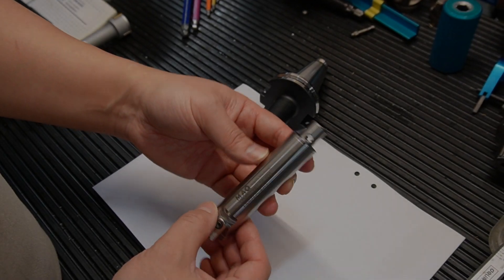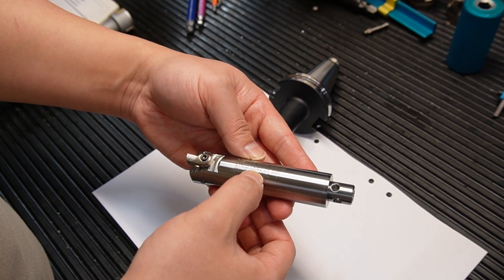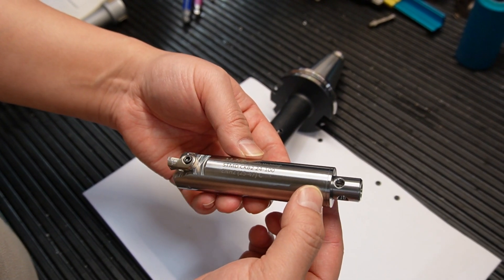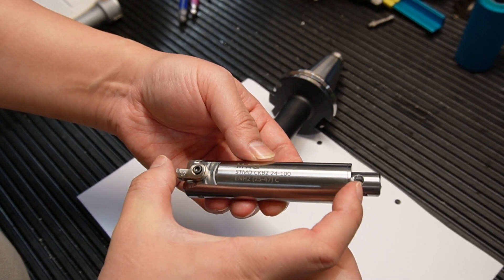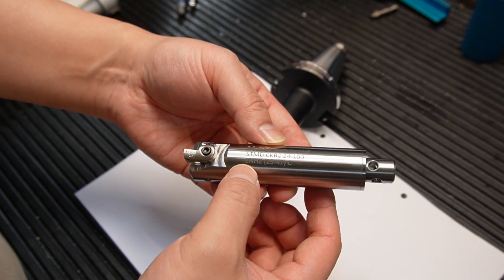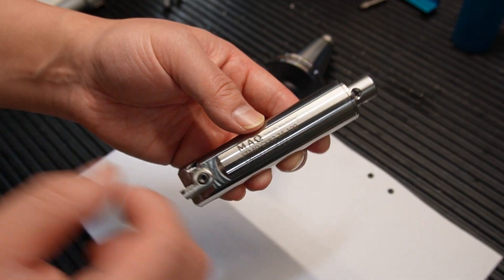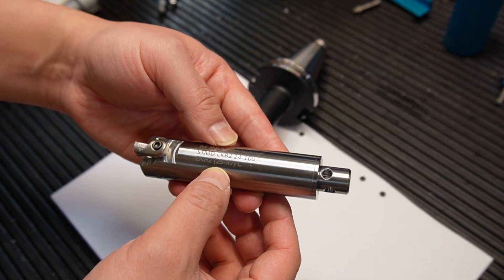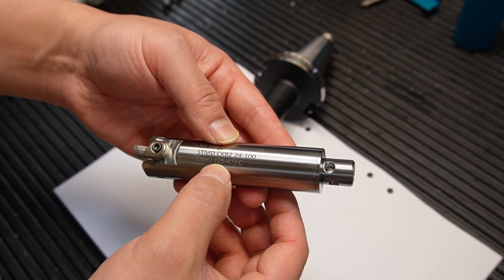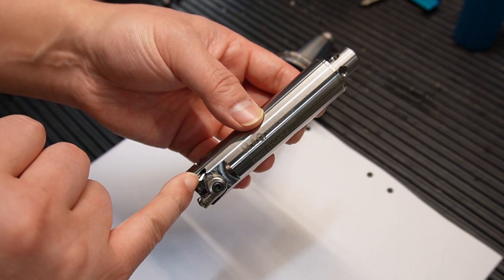What I'm holding in my hand is a CKB2 type, and the diameter of the body is roughly 24 millimeter. The total length is about 100 millimeter, and it has an ENH2 type connection to the insert holder. With this body, you can make holes with diameter range between 25 up to 47 millimeter. And of course, it has coolant through.